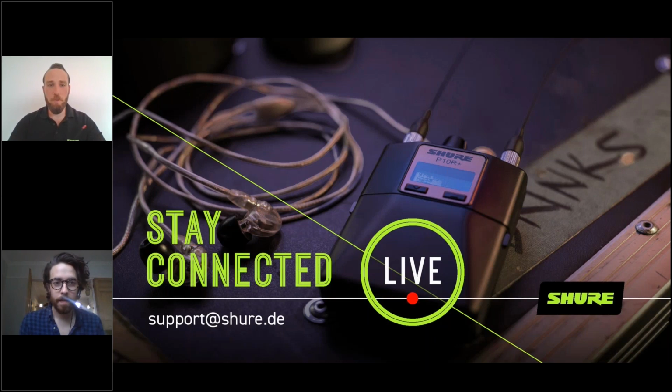I can leave you with one more thing. If you're using in-ear monitoring together with another wireless pack, always make sure to bring your body in between the receiver and the transmitter on the other side, so they don't take away energy or create intermodulations, which would result in dropouts in your signal, right? That is a really excellent parting tip.